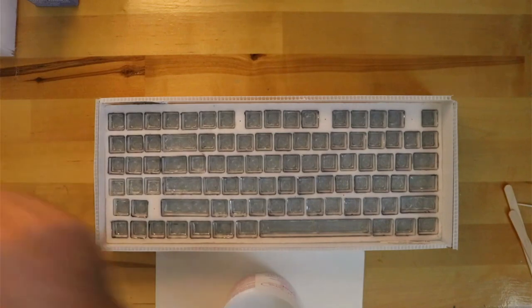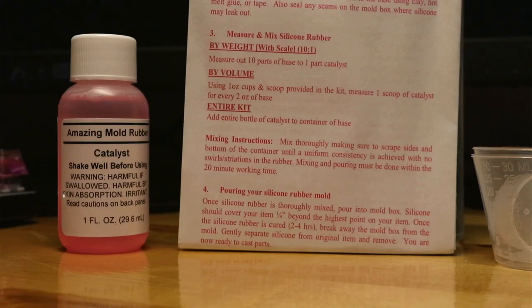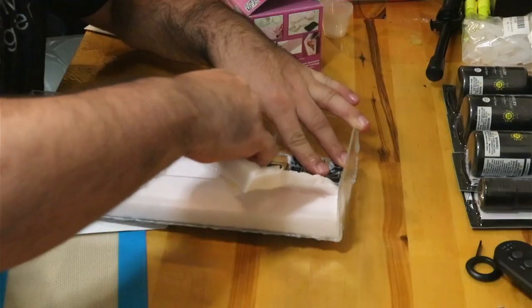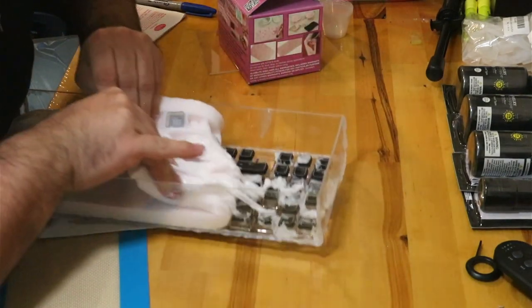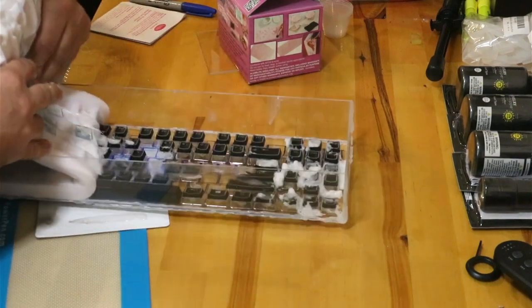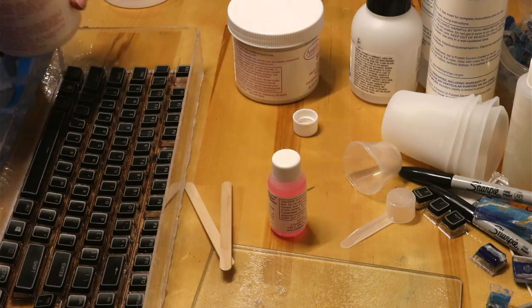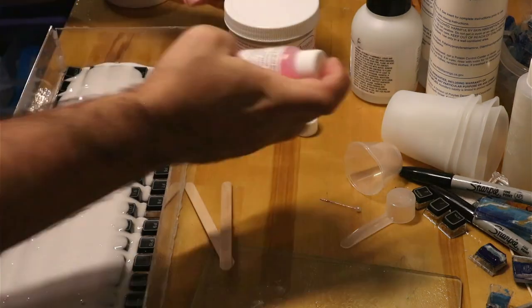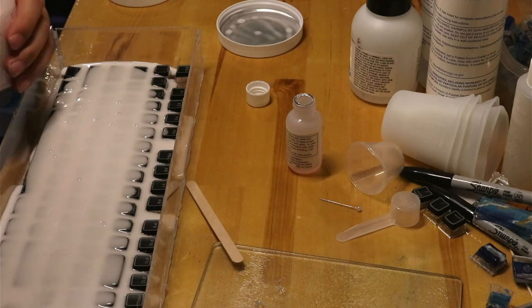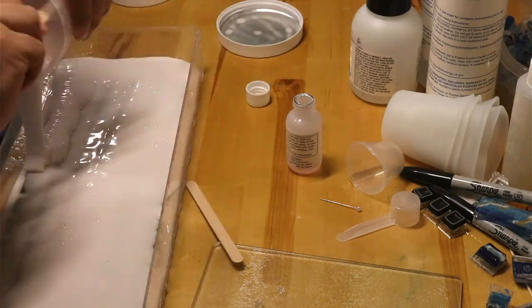When working with silicone you should shake the catalyst before adding it to the rubber. Use the correct ratio of catalyst and make sure you let it cure at the right temperature. If any of these three are not done you could be left with uncured silicone. The right temperature is between 74°F and 80°F — I ended up having to buy a little space heater to make this work. When mixing, use movements that don't introduce bubbles; I used a popsicle stick with very small circular movements. Try not to lift the rubber but be sure to scrape the sides of the container. I used two containers of silicone for the first pour and two for the second, though I feel one and a half may be possible but wasn't worth the risk.